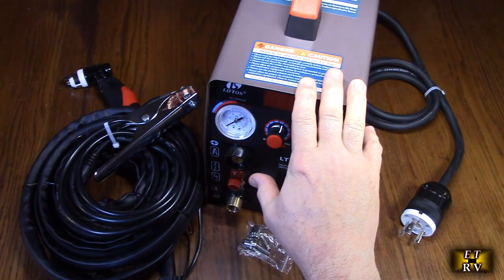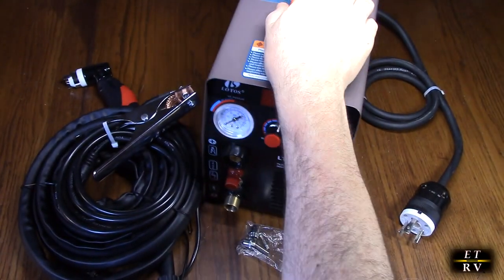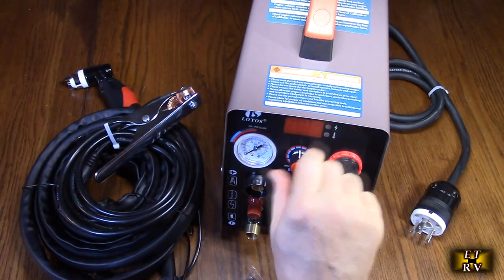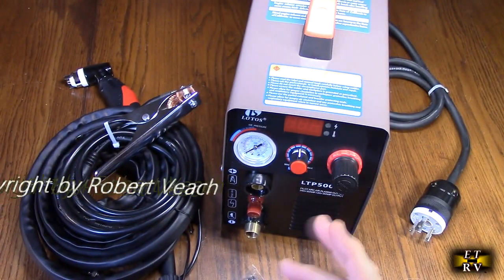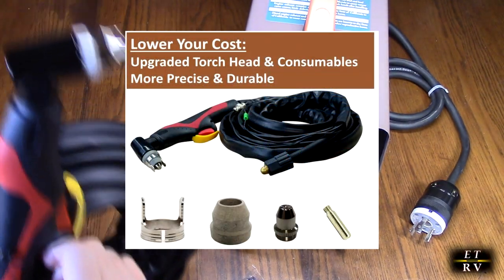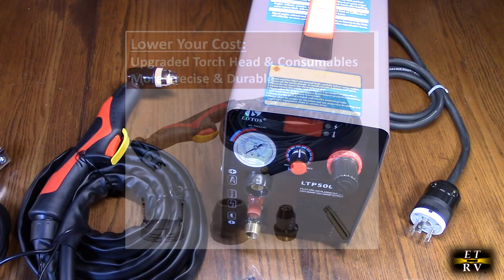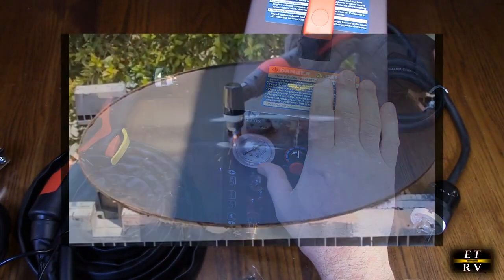What's unique about this is they've developed a 25% increase in the actual cutting ability. What they do is take the 220 volts and convert it to a DC voltage, leaving DC high current voltage, which is sent through the tip and is what's doing the plasma arc cutting — that combined with the actual air. That 25% increase is what makes this unique, and people are just loving this.